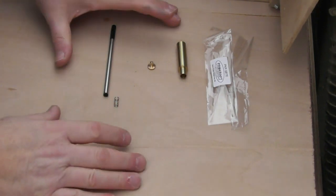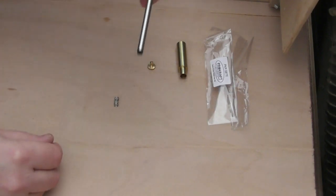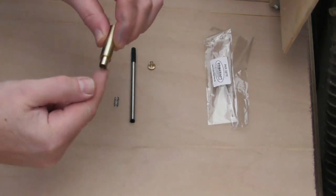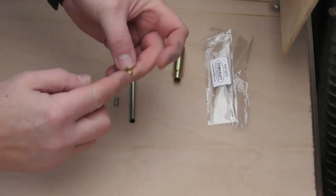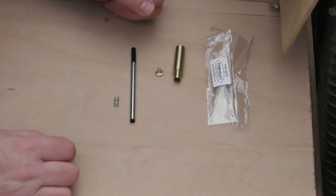The drilling for this I'm not going to show you but I will explain what I've drilled. You basically need a 7mm drill for the refill, you need an 8.5mm drill to fit the nib connector, and you need a 4mm drill for the end cap. They're all pretty standard sizes so that shouldn't be difficult at all.